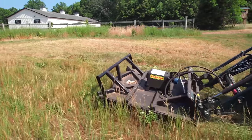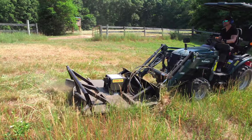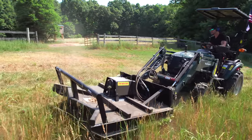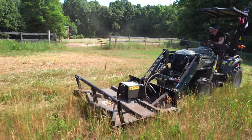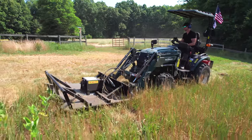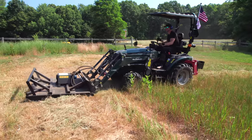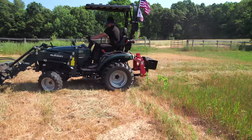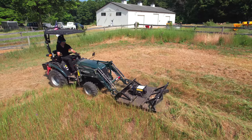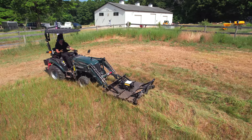The flip side is there are no gauge wheels on here — similar to a skid steer mounted brush hog, which also has no gauge wheels. So you can find yourself getting an inconsistent cut height as you're going over bumpy ground, trying to manage the loader height. Whereas on a three-point, it floats — it'll hydraulically lift up, and you have a trailing gauge wheel to help the machine follow along the ground contour.